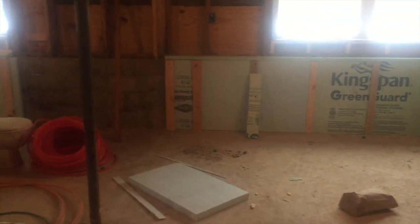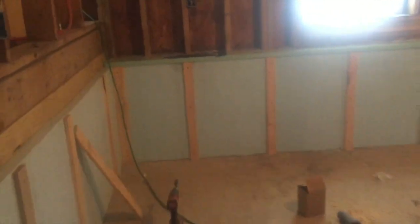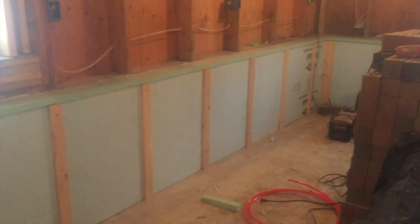So that's what we're up to at the split level today. Try to get some video footage of how you want to do this in the wall heat. Like I said, I've done it in a couple houses. It works really good. It's good for radiant retrofit where you can't get into the flooring to put tubing in the flooring, and it doesn't really work to put tubing in the ceiling very well. Thanks for watching.